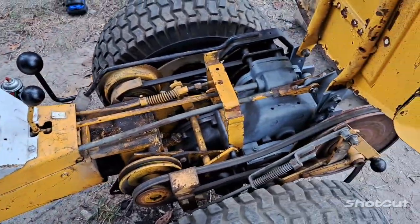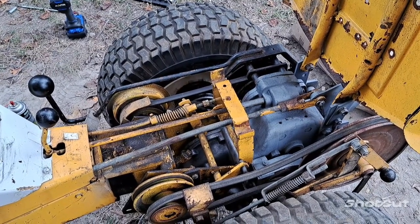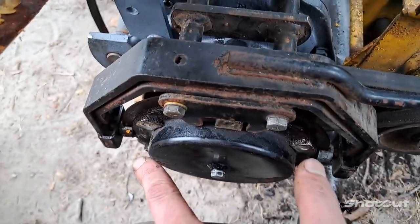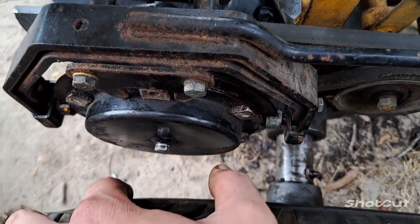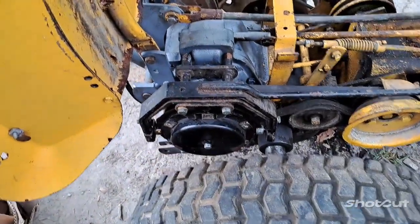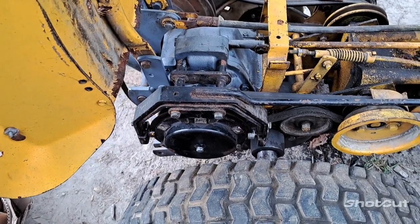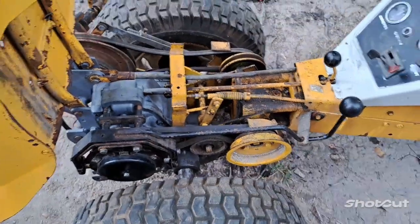I will continue to do more with this little thing. I have never had one that had the high-low so I'm going to check it out and see what it's like - I'll let y'all know. The fingers or dowels that actually go in here have a little bit of play in them, and the back one too, so eventually I'll have to get somebody to make me some of those probably. I also greased everything up - you do have to pull that little 7/16th bolt out, put in a grease zerk, and grease the planetary gears in it. My goal is just to keep stuff nice and make it last longer. Thanks for watching.